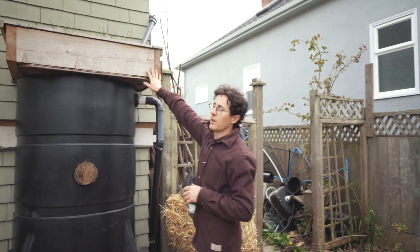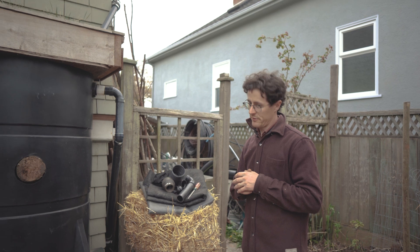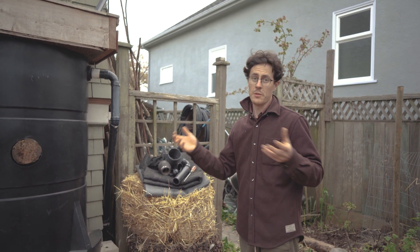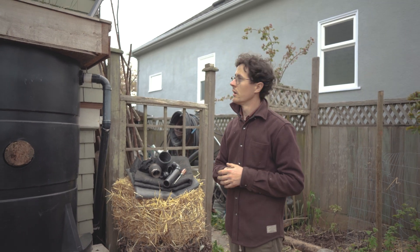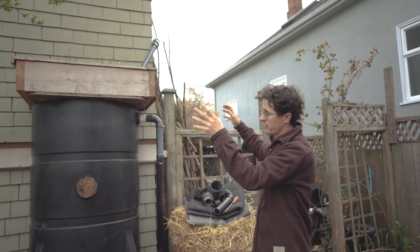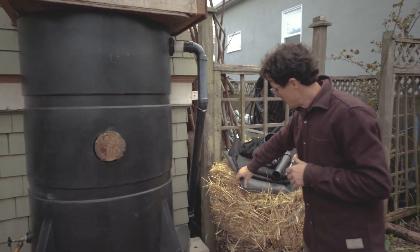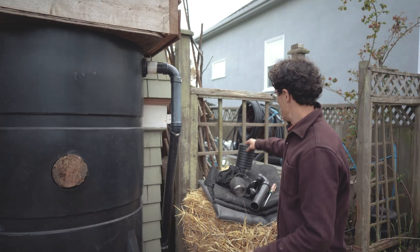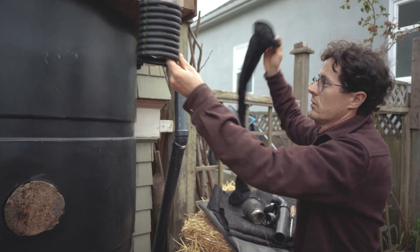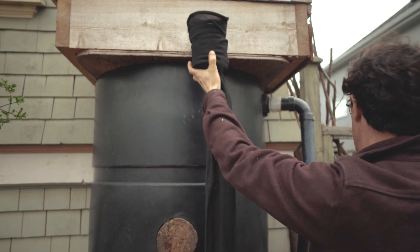This is a wetland system. The reason to flush that first five or ten liters is that rainwater, although it sounds great, can be very dirty — it'll have bird feces, whatever's lying on the roof, and sediment like leaves and brush. This wetland system provides both primary filtration and takes care of the first flush. On the bottom we have EPDM pond liner — this heavy material — and running through it is a four-inch perforated pipe with a sock on it, pressure-fit through a hole drilled in the wood and into the pond liner, and that drops down into the tank.